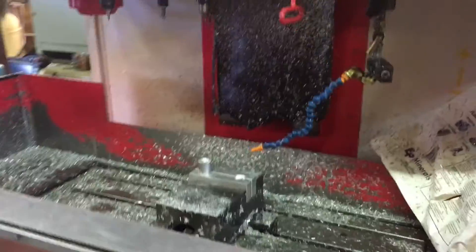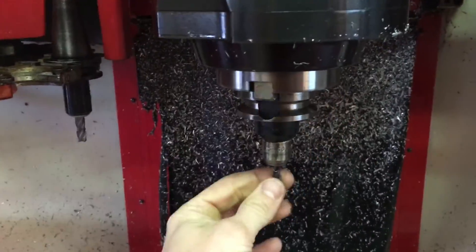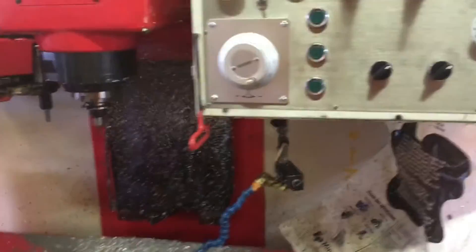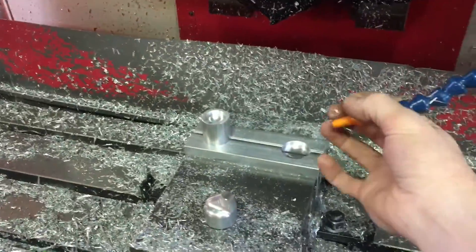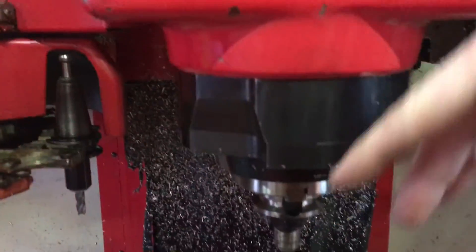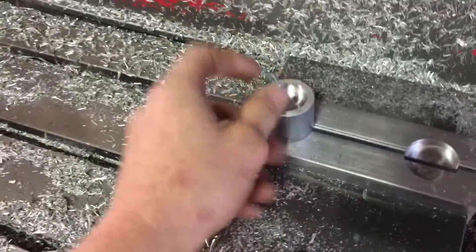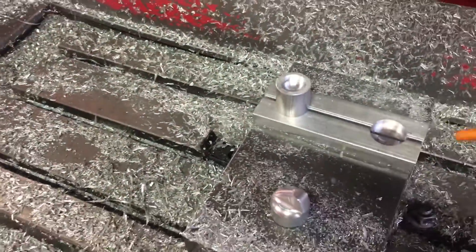I have a problem with coolant on my machine. Whenever I run the coolant it catches on whatever tools are up on the tool holder and flings coolant everywhere. I don't have a full coolant enclosure, just a splash guard. Another problem is the coolant pressure is pretty paltry. More modern CNC machines usually have a ring of nozzles around the spindle — some machines even have 500 to 1000 psi coolant — which keeps chips flowing away from where you're cutting, especially for deep pocket milling.